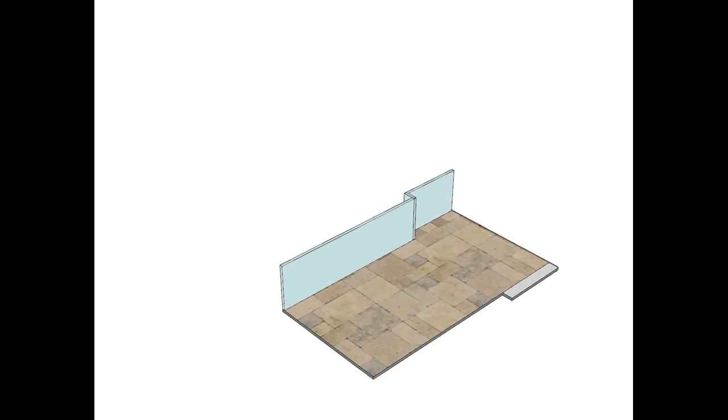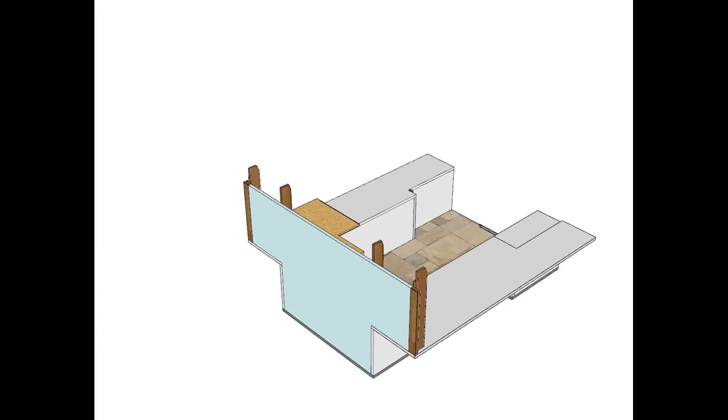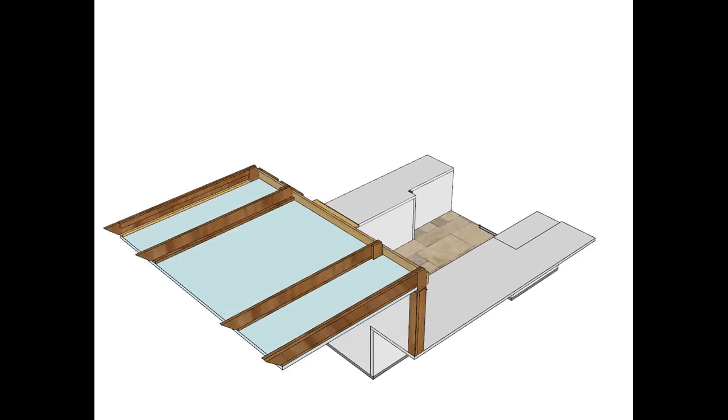Here is a quick 3D tutorial on the camper build. I started with the floor of the camper, adding a single piece to the floor. Next, I added the pieces to clear the truck's bed rail, followed by the water tank support. Another layer of fiberglass was added to the bottom half of these pieces, as that would eventually support the weight of the camper. The lower cab support piece was then added, along with the framing for the water tank. The cab-over support was then constructed using 2x4s, 1x4s, and 1x2s. I then worked on the lift-up bed storage area, as I knew this would be difficult to install once the sides were attached.